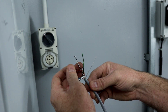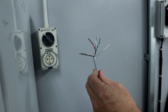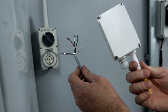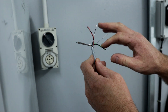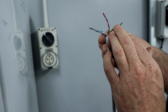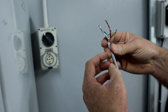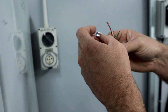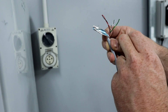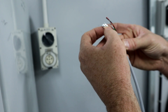This is what the cable looks like — we've got three twisted pairs, all for signal lines. This probe has temperature and humidity detection, so we use one twisted pair for temperature and one for humidity, with one spare. This wire is the ground and the shielding protects the inside from interference from other voltages or currents running nearby.